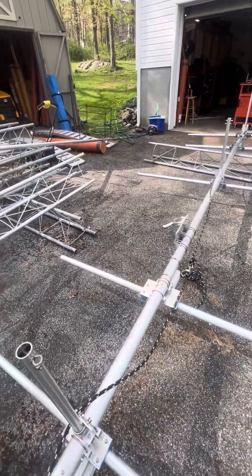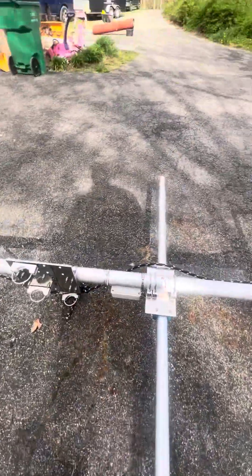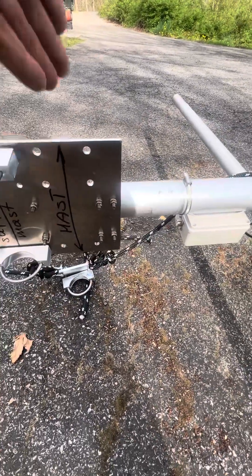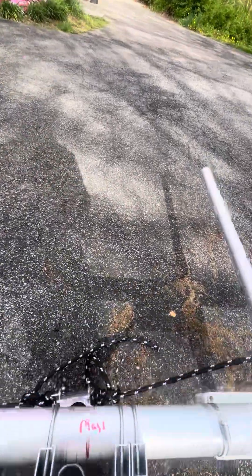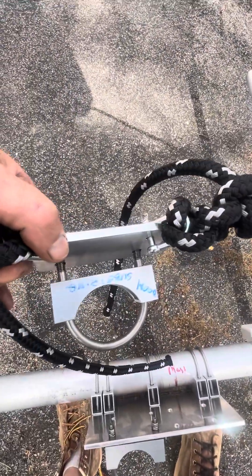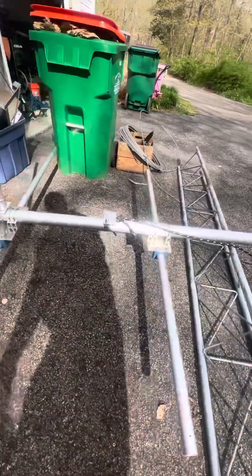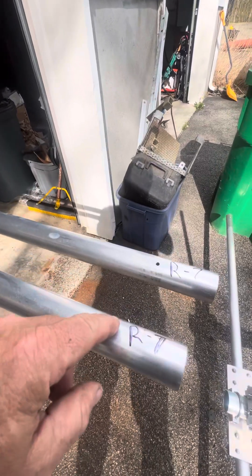This is a very well-manufactured antenna. The GXP seven-element seven-bander is the Polish miracle and the material is really nice. We get a support mast here that he supplies, and Bobby's already got the support bolted on. Bobby's working on the reflector.